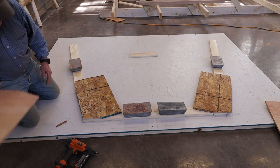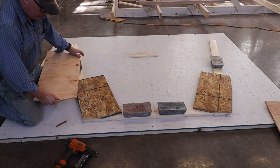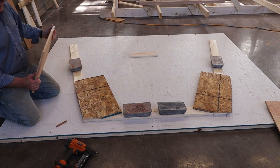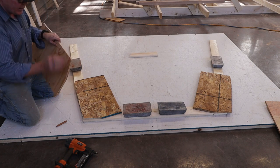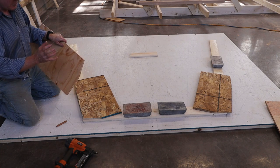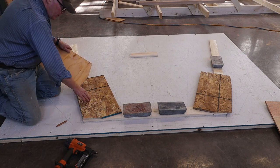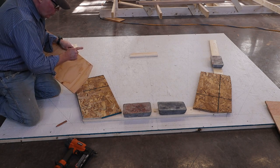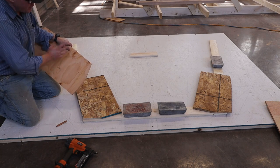On the underside we'll have a piece of plywood, and the reason I'm having ply on one side and OSB on the other is because the ply is a half an inch, and that is the offset I've set up. The OSB is approximately half an inch but it tends to expand and change its thickness a little bit, so it's not that reliable. Why am I not using ply on both sides? Well, you could, and that's a good solution, but ply is about twice the price of OSB and I really only need the ply on one side — so that's the reason.